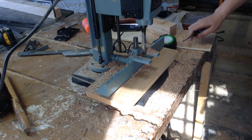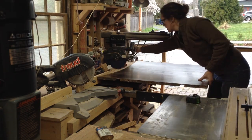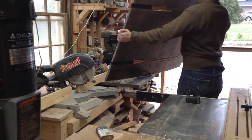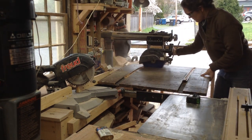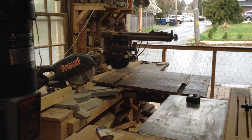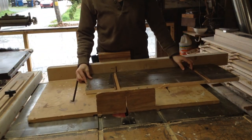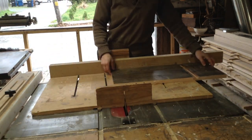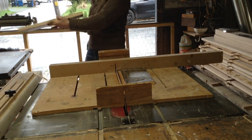This piece is actually for the same customer that ordered the table from me that I fixed in last week's video. Luckily I was able to repurpose a lot of the top — you could see just how bowed the top is while I'm cutting it down on my radial arm saw. If I hadn't cut those huge grooves in the bottom, I would have cut it down into lengthwise strips and then flipped and re-glued them so that the grain on the end of the boards was oriented every other.